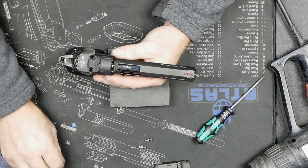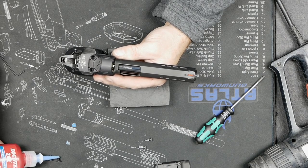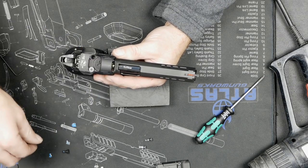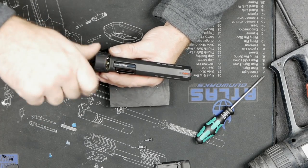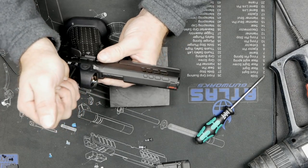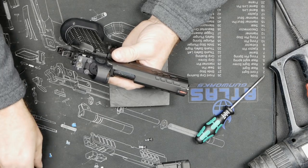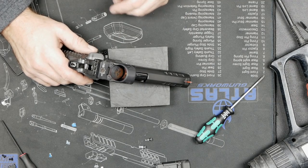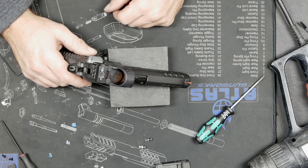With the SRO it's going to be the same thing — I'll use a little bit of blue. We're about to list Allen keys for all of these on the website; these should be 2.5mm if memory serves. I do a little less Loctite when putting on the optic, since it's easy enough to check because the screws are on top. I can use heat on optics, but a lot less — there's plastic and electronics to worry about. So I try not to ever need heat when the optic is right there. Once the optic is out of the way, heat's not really going to bother anything.